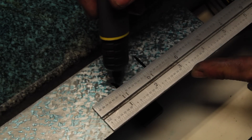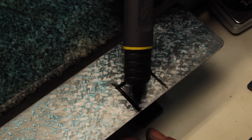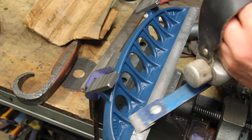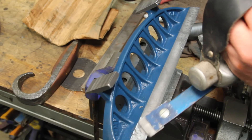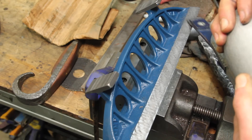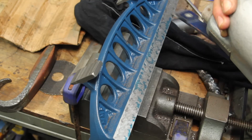I did a couple more rounds on this thing, and overall I'm pretty happy with how it's going. I'm just laying out a one-inch square here so I can do a point count. I'm pretty happy with that. Then it's the same procedure for the dovetail. In case you're wondering, I'm just holding this thing on a magnetic V-block.